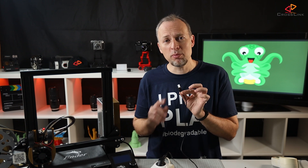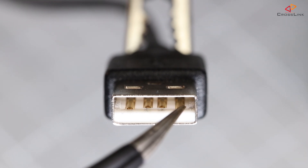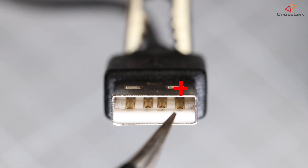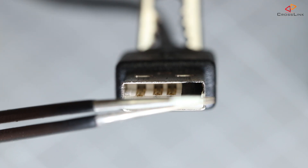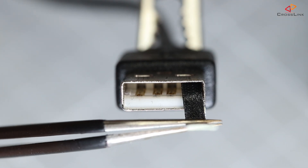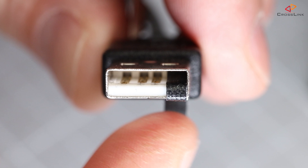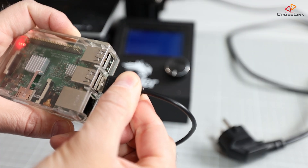There's a simple hack to fix this. The USB-A plug that goes into the Raspberry Pi has 4 pins. If you look down on the pins with the metal pins facing up, the rightmost pin is the plus pin — that is what powers the printer from the Raspberry Pi with 5V. If we just take a little piece of tape and place it over this pin, we can still use the USB cable as a data cable without it being a power cable anymore. And you can see — no back-powering anymore.